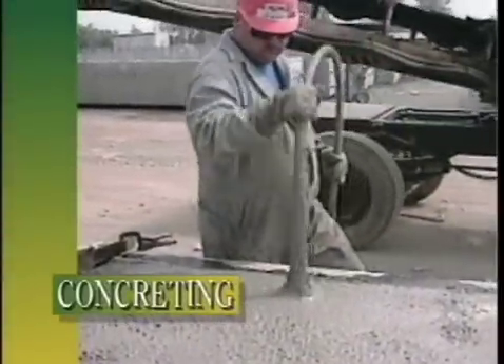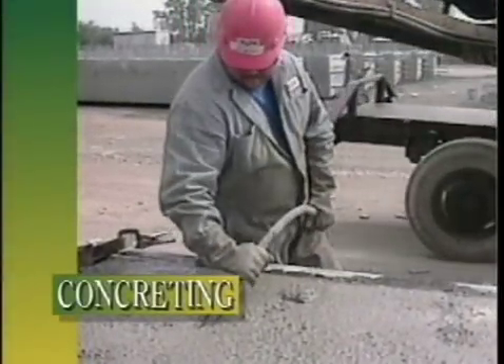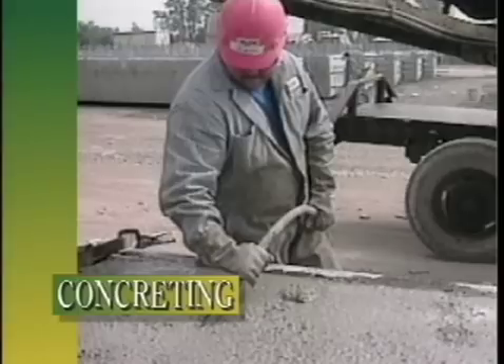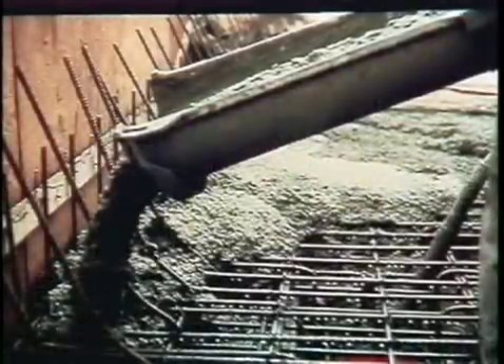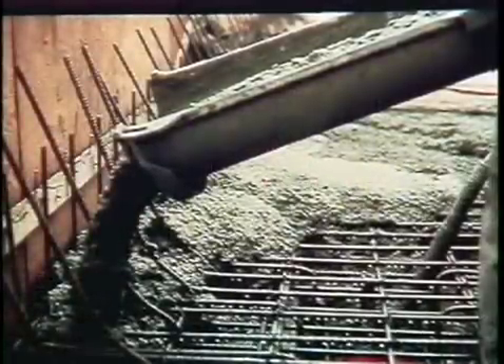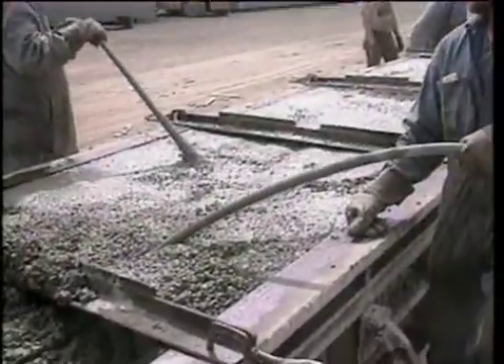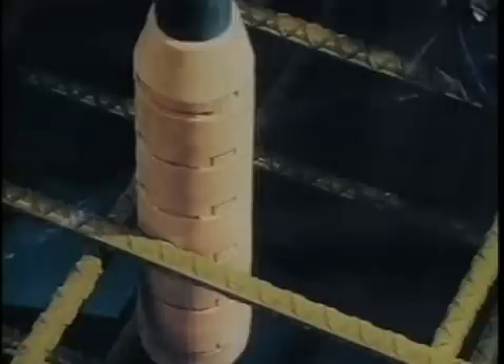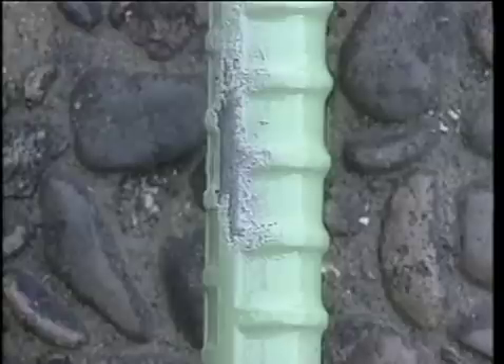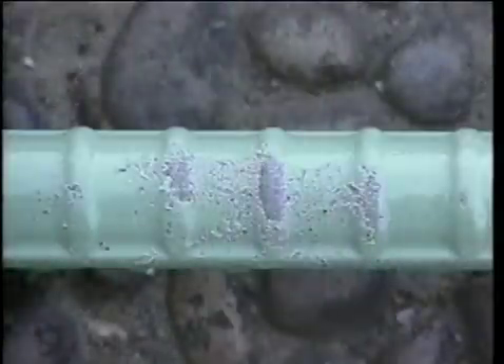When pouring the concrete, take caution when walking on the rebar not to drop anything such as hand tools or construction materials on the placed bars. Set up runways for concrete buggies and pumping hoses and properly support them. Maneuver carefully to minimize damage to the coating and to prevent shifting of placed bars. When vibrating concrete, use a non-metallic or rubber vibrating head to minimize damage on placed epoxy coated rebar. Metal heads can cause damage to the coated bars within the concrete.